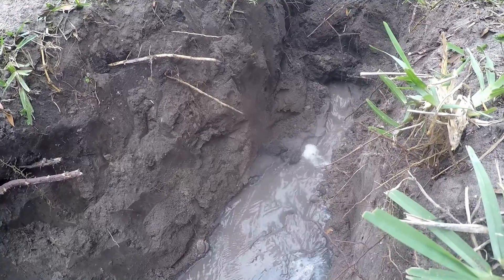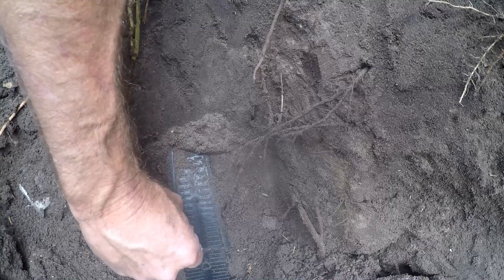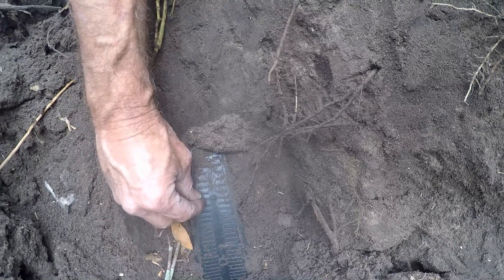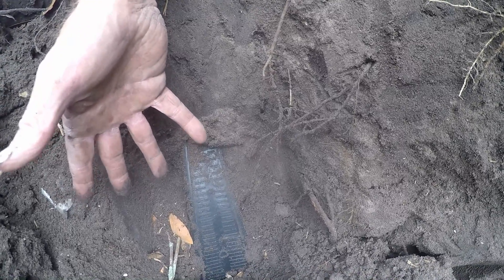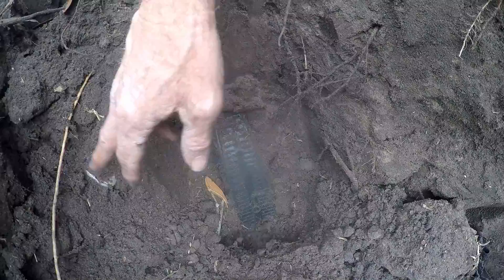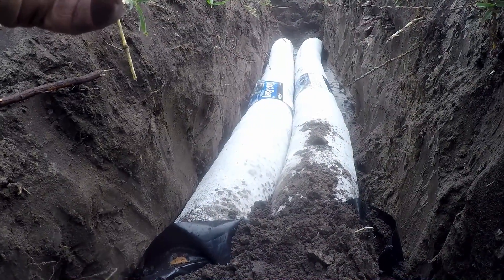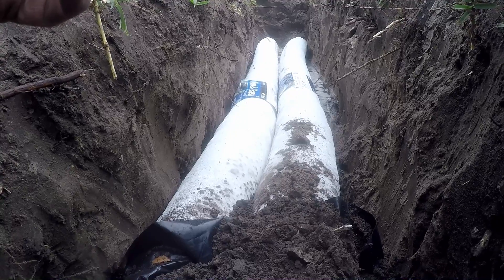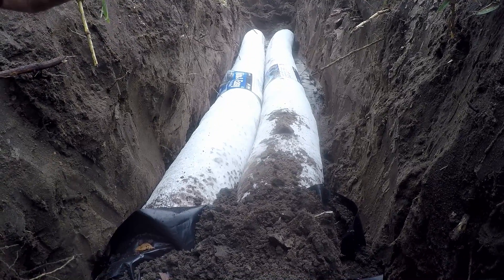I really think that gravel works a lot better. Styrofoam peanuts — that's the same as gravel, so it should work really well. Here's the side of the chamber — the bottom is just right down here. Our pipes go underneath the chamber, into the chamber. You can see how the chamber works — it has little slits and vents, so it's been slotted. What's happened is that the water's not escaping out of the chamber anymore, because the soil is saturated with phosphates and just can't penetrate. So we've added more drain field — 20 feet of our Easy Flow Drain NDS product, doubling it. Now when she runs her washer, more capacity, and that water should dissipate fairly quickly.